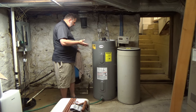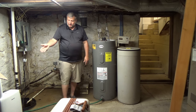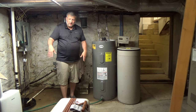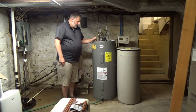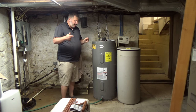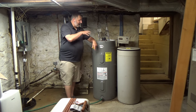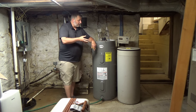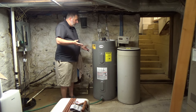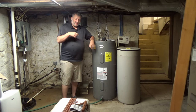Visually, I don't see anything going on here. There's a little bit of water down here only because this Michigan basement seeped water in and my dehumidifier is full, so I'll have to dump that in a sump crock and get all that moisture out of here. Coming back to the water heater, I don't see any evidence of it working or not working. The only real evidence would be to open this up and look inside, which I'm not going to do. Visually it looks fine and there's no sulfur smell in my water — but I think that's because of taking the magnesium anode rod out.